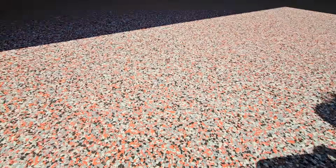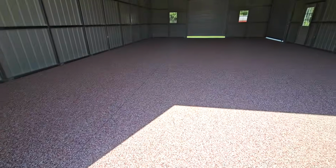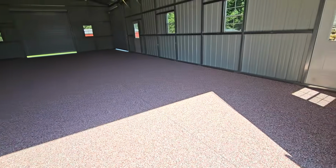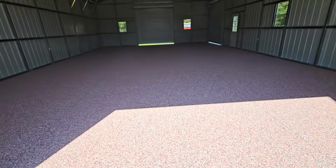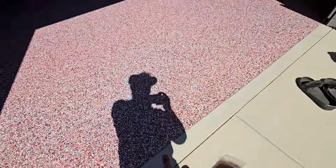And make sure you get enough up. If you don't scrape well enough, you're gonna leave a little bit too much flake on the floor. And then when you do your top coat, it's gonna absorb a little bit more material, kind of sucking into the valleys and gorges there. So really important to do a clean scrape. Got the joints cleaned up. Got the transition line nice and clean, beautiful for a clean finish right here.